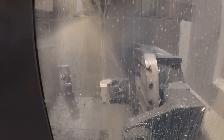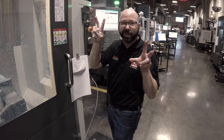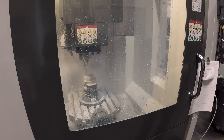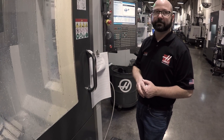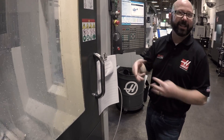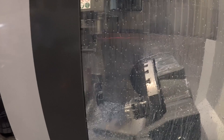We're using the large TSC drill to clear all the chips from the table so the operator doesn't have to — we've already got the squirt gun. We run a little car wash here at the end of the operation. I was thinking about this because I have a chip fan from Lang, but it's expensive and takes up a tool spot. I've got TSC — why not just run a drill or a holder and clean the table that way? For a one-man operation, I don't like getting soaked — let the machine do it. The part is about to flip; we're just dumping the coolant out. The car wash is actually at the end of the second operation — it's showing the right way to flip the part.